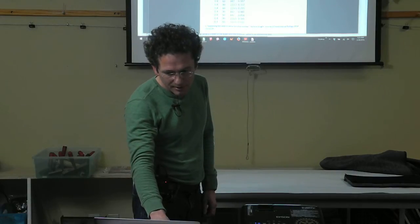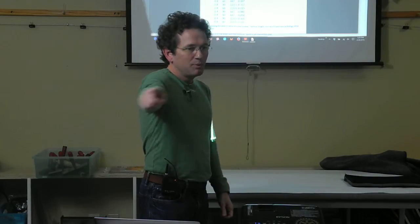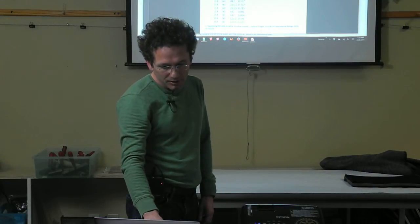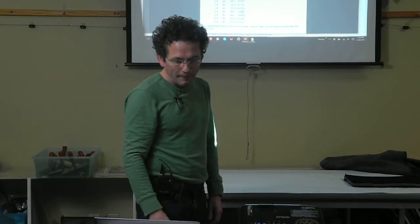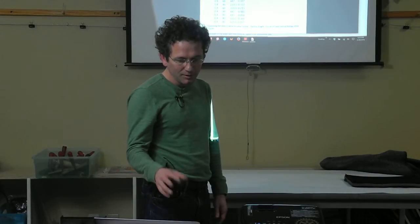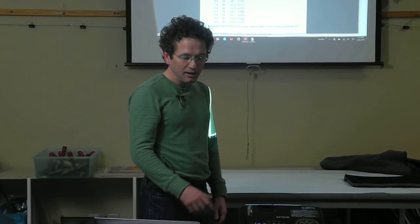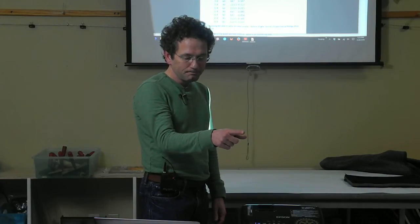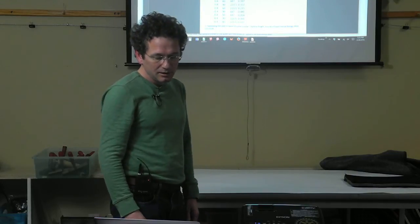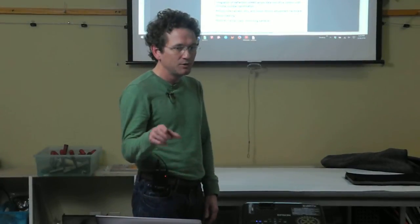F is the frequency. L is the amplitude, it's called the characteristic length, how far it's going from peak to peak. And then U is the overall speed through the water. And for fish, the Strouhal number is typically 0.2 to 0.4. And my Strouhal numbers are about 0.16. And oddly, what it means is the back end of the tail should be going further. It's interesting. But the next circuit can drive toward optimizing that Strouhal number.